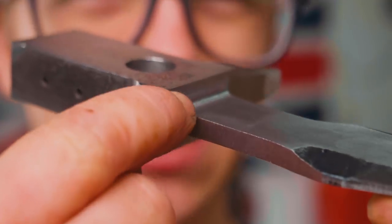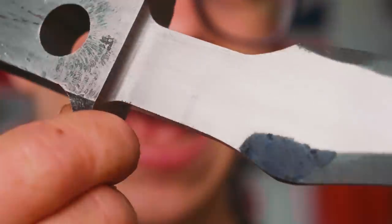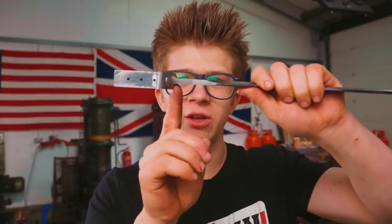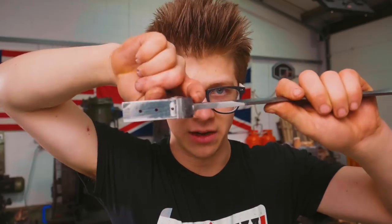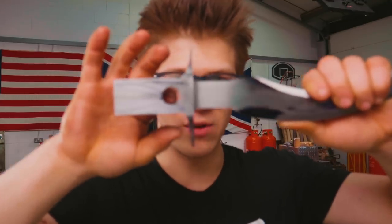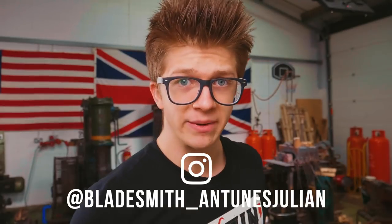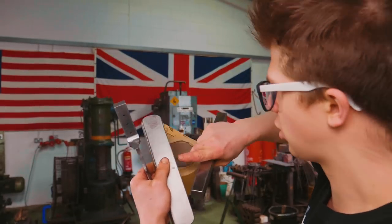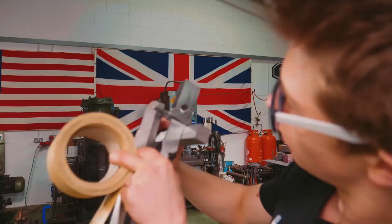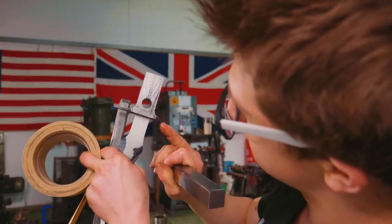What I was trying to do is sand in this radius here while it was soft before heat treat, and sand it in all the way around — only to 80 grit or so — to ensure that while it's soft it is straight, flat, and nicely transitioning in there. We also did it top and bottom, made sure this is still central to the material and central to the hole we've made for the keyhole. This sets us up so that hopefully after heat treat we can again use those tools — the idea from Nick Wheeler's knife making tutorials on YouTube — some PSA adhesive, these blocks here with a radius on the edge, to get in here and ensure that with the correct radius we were able to sand this section square to that section with a neatly flowing radius.